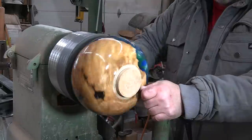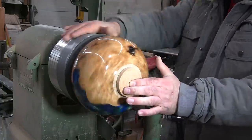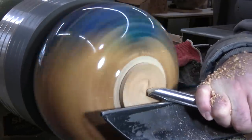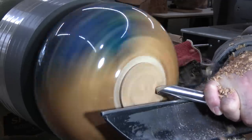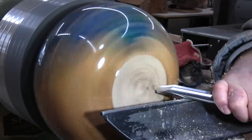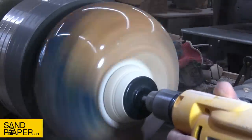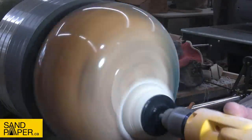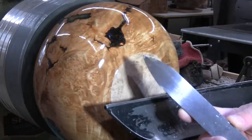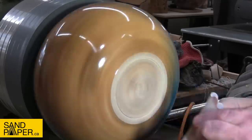I'm using my one-way vacuum chuck system — it took a little bit to get this lined up. Outboard you have to just eyeball it until you can get it running true. I took the waste block off with the bowl gouge from David Ellsworth, the 5/8 bowl gouge. Then I started sanding the bottom at 120 all the way to 320 — I didn't see any need to go higher than that since there's no resin. I also decided to use the spear point tool again to put a little groove on the very bottom of this piece, just to dress it up slightly. Let's finish this video up.